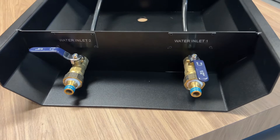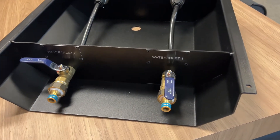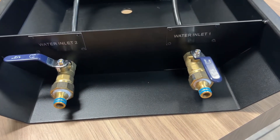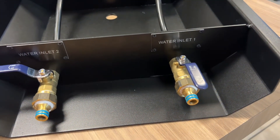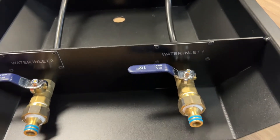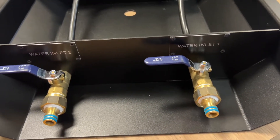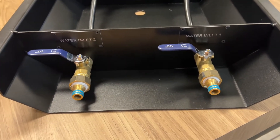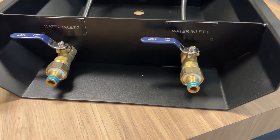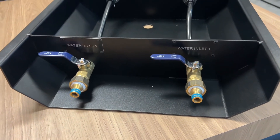You can just connect up the hose and walk away, and once the breather in the tank starts overflowing you know that you're full — or just monitor your Holman water flow meter, which tells you when your tank's full by literage. Then you simply just disconnect it, turn the valve to stop, and we'll also be designing a cap cover to go over the connection point to make sure no dust gets in.